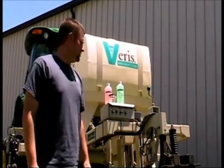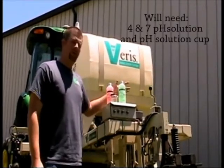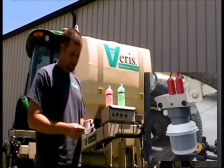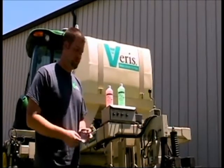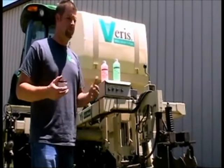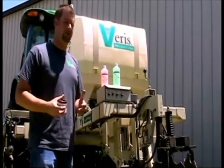To run a calibration procedure, what you'll need is the 4 and 7 pH solutions as well as the pH solution cup. This solution cup allows you to put a small amount of solution here and attach it to electrodes. Now following the on-screen prompts, you can successfully complete a pH calibration.